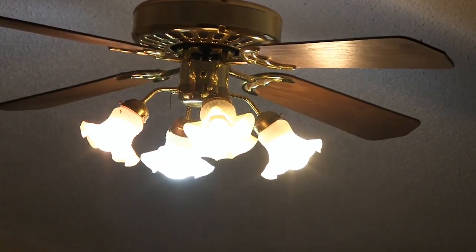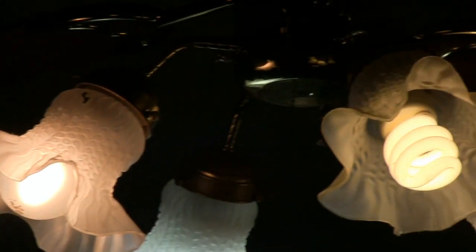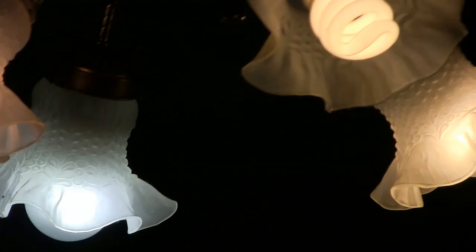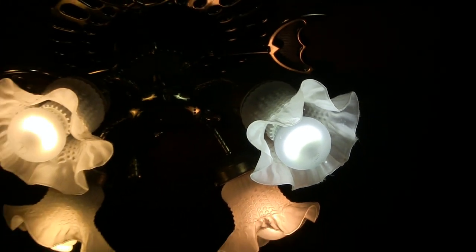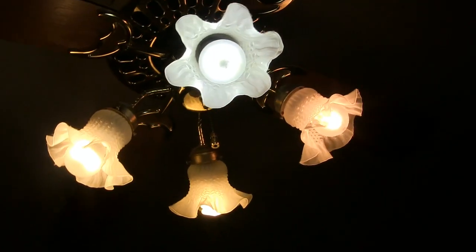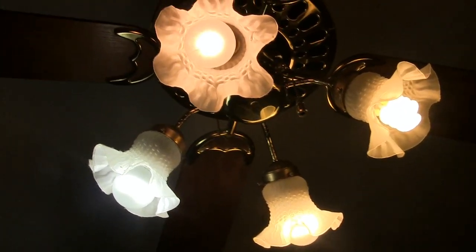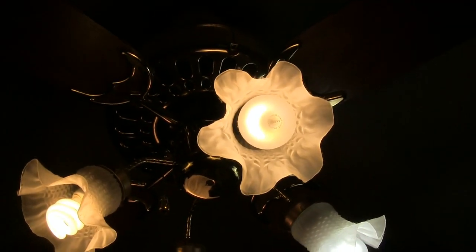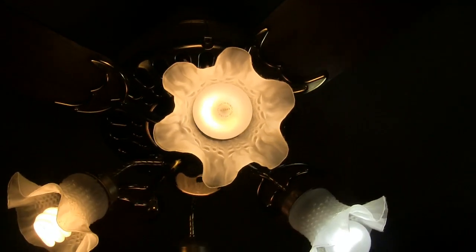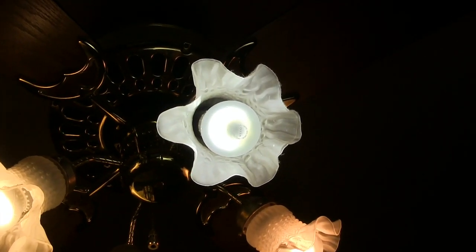Here I am at the switch, and there are the lights. This one is the incandescent, compact fluorescent. The 60-watt LED Warm, and the 60-watt LED Daylight. Quite a difference in the colors, isn't it? The incandescent has sort of an orange tint to it. The compact fluorescent is a darker yellow. The LED warm white is pretty much yellow — it doesn't have the orange or the dark yellow. And then the daylight is what people are typically used to seeing with LEDs: that whitish-blue, really bright, stark light.